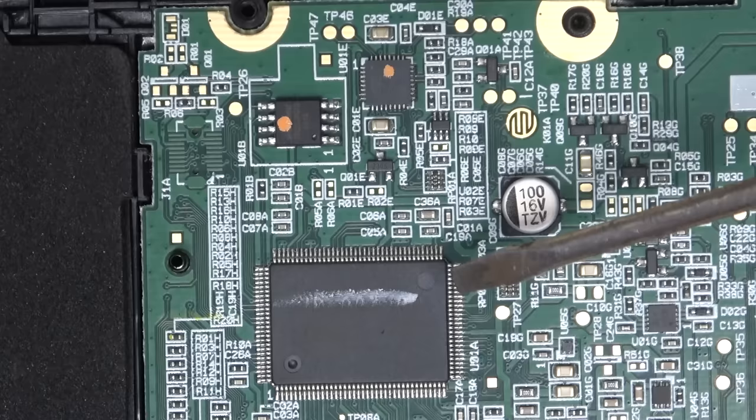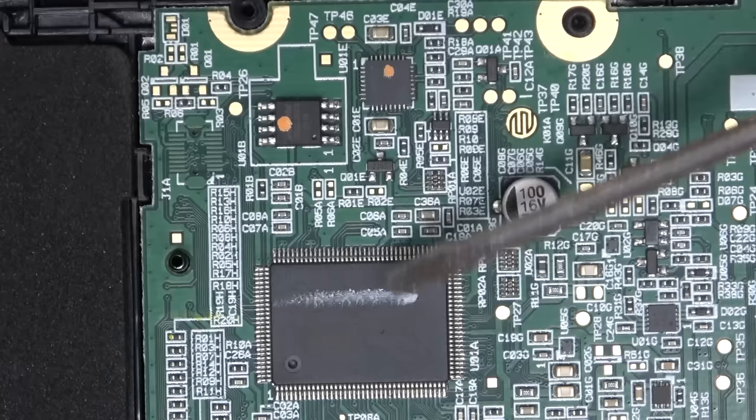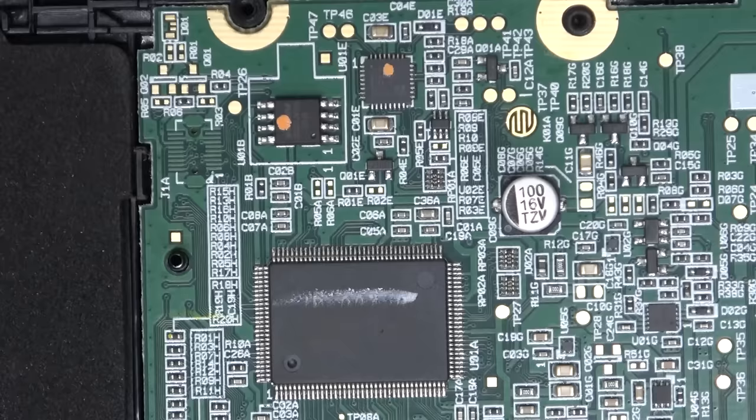I don't know enough about Python to qualify that, but it would seem like it'd be bad because it's an interpreted language. It's running on a really dinky, probably bottom of the barrel microcontroller that could even run Python. And then it's swapping the data with this. So it's kind of almost like having a coprocessor. Well, actually it is exactly like having a coprocessor.